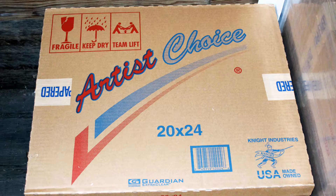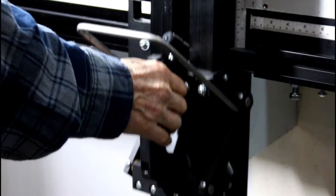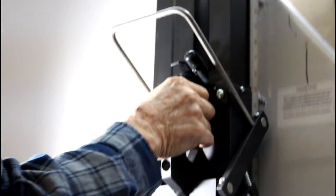Put the razor blade cutting tool on your Onyx 90 Multimedia Cutter and cause the razor blade to descend into the groove. Move the cart with the razor blade descended into the cutting groove up and down to make sure that you do have free travel.